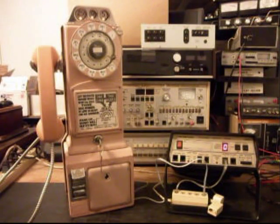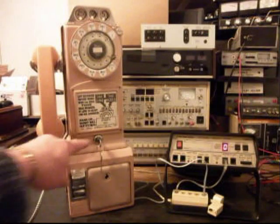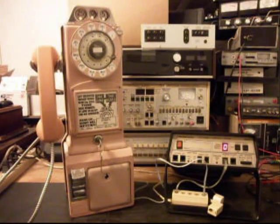And so also, this telephone, we put an aftermarket cam lock for Gene in this telephone, so the body does lock now. And the vault lock was broke a long time ago, so it basically just opens with a screwdriver. And Gene's okay with that because he wanted to save some money with this telephone. And he has a phone booth that this telephone is going to go in. So this telephone, we did not install a bell in it, so it does not ring, because the telephone booth already has a bell box inside.